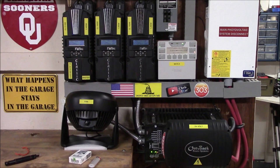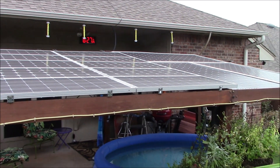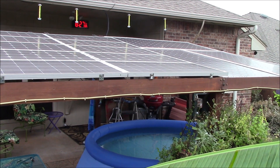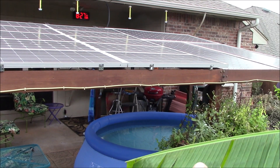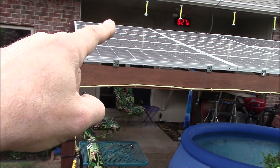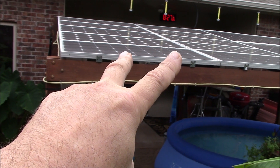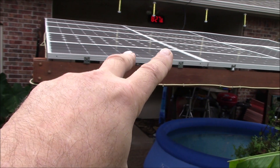That's versus 4,900 watts before, so that should help for winter. Let's go up to the array and I'll show you what's going on. Over there are the three SunPower ones for 1,300 watts — their open circuit voltage was about 76 volts. To mate it up with the 1,000 watt array, I had to take two panels off.